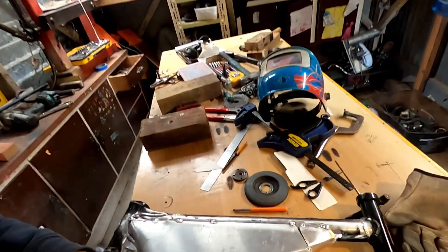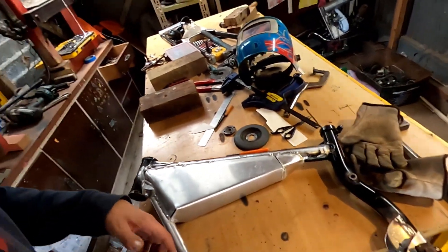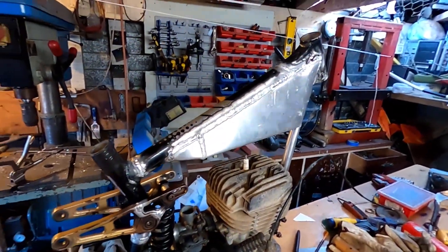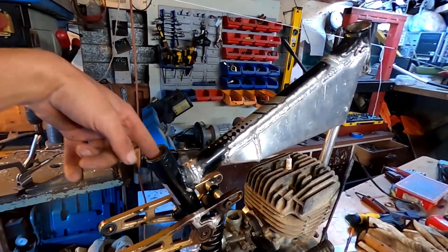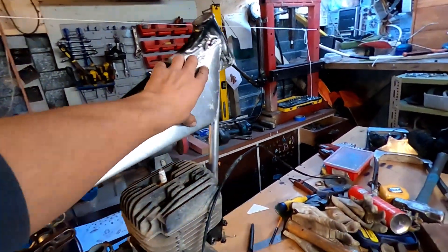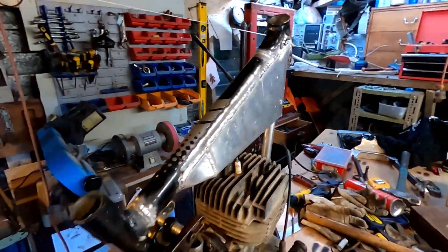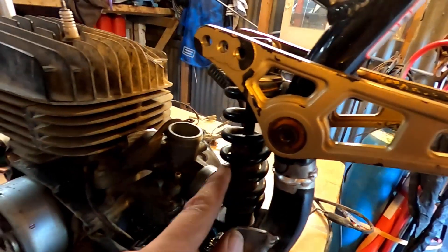The GoPro is almost flat — I've got that tacked in there now, bit of a gap there but that'll fill up. I've got the fuel tank all welded off. How I'm going to fill it up is by putting the fuel down this tube here — it's not going to be at quite this angle, and that will fill all that up. The seat post will come up to about there, I'll have the end blanked off with a breather that goes up to the handlebars, and the fuel is going to come out about there, from there to the carburetor.